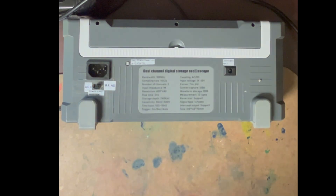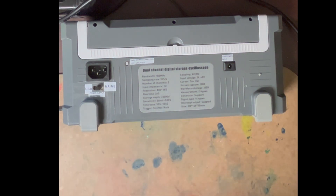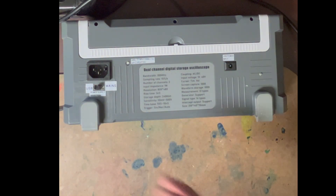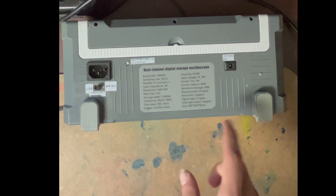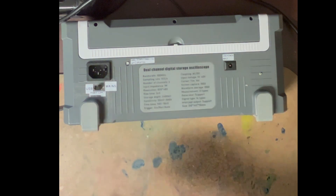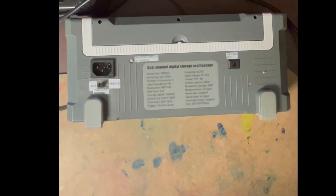Since then I took out the 18650s. I still have the USB input, and I've added a switch and a mains input over here. You can either power it from USB — and then power the USB from an external power bank — or you can power it from mains. I put an internal mains power supply in there by taking apart a USB adapter and mounting it inside. Much like on my power supply, you can select between USB or mains.